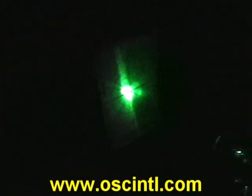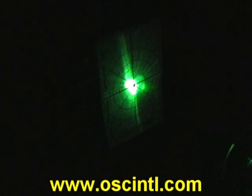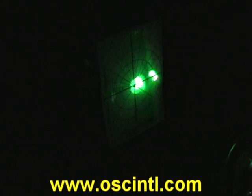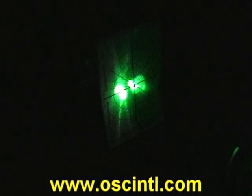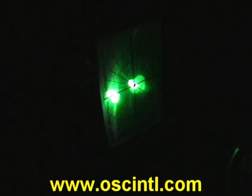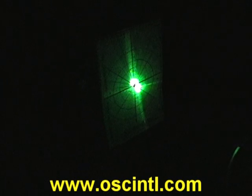Going over to look at the back of the first target now, I'm moving the reflection spots by tilting the lens. We have two spots here and another two spots here that are moving. What I need to do is get those two spots — one from the front surface and one from the back surface — overlapped on top of each other and centered on the hole. I'm adjusting the lens mount, turning the knobs for the azimuth or lateral adjustment.